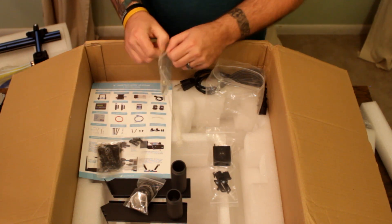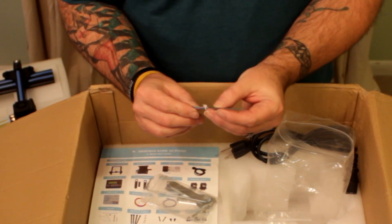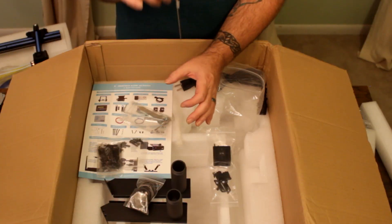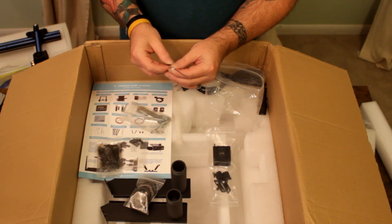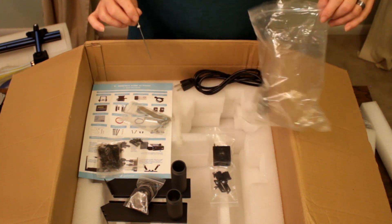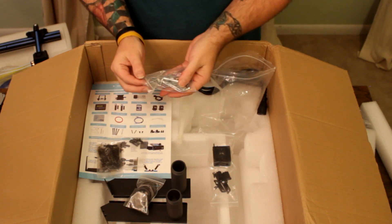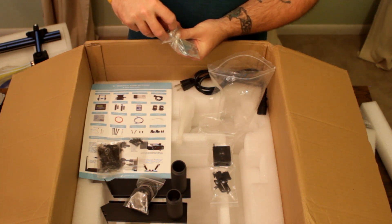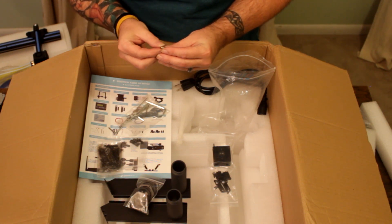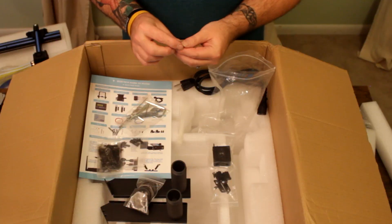And this is really awesome — I use this quite often. It's a nozzle cleaning tool, and this one actually has two sizes: a little tiny one and a larger one, to go down in and clean filament clogs out. If you have a clog blocking your nozzle, you heat it up and push this down in to force it out. The big one is normally all you need, but if you have a more stubborn clog you can use the little one to get a pinhole through it, making it easier to clear. You also get an extra nozzle — since it's a dual-feed system it all goes through one nozzle, so that makes sense. It's probably a 0.4mm, which is usually what comes with these.